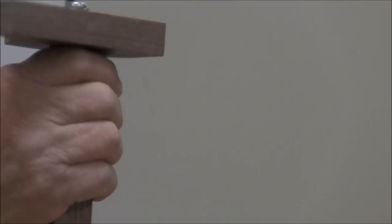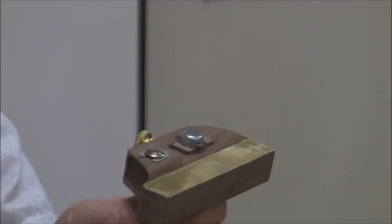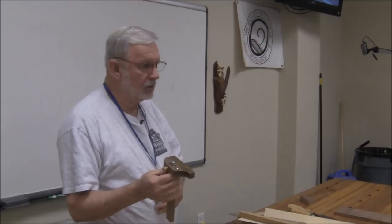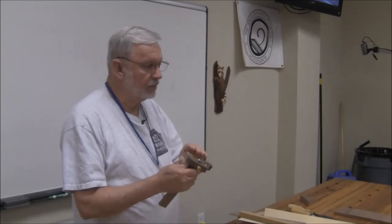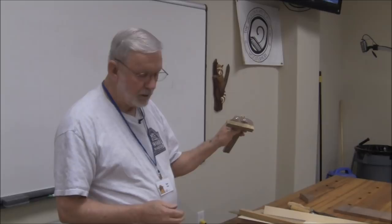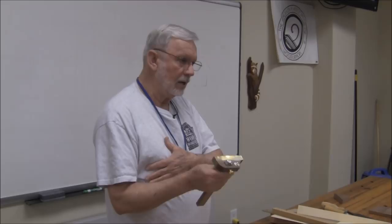How do you know when a saw tooth gets dull? If you hold that blade up to the light and rotate it back and forth, you'll see little shiny spots right on the top of the tooth — that's how you know it's dull. Sometimes you can press your fingers straight down and if it's really dull you'll know it. Sharpening requires a special file called a triple slim. I use one called a Grobet — G-R-O-B-E-T. It's very expensive, but it will last forever if used correctly, and it cuts like a new razor blade.